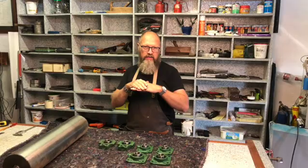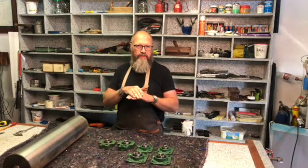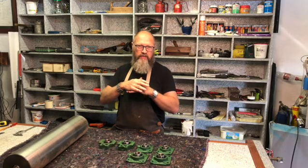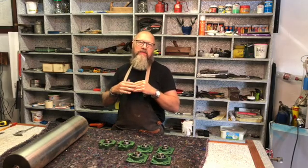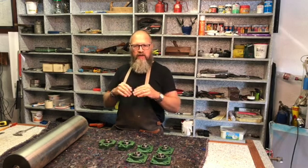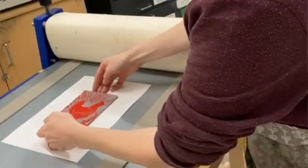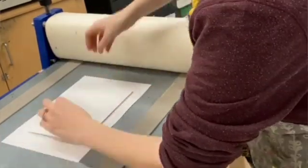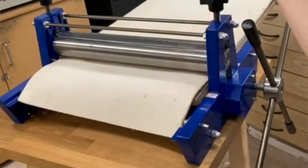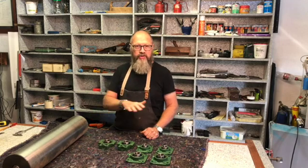On top of the plate you basically have a blanket and you put your etching plates, then two blankets. There's another blanket on top of that. Sometimes there's a third, thinner one. But mostly it's just two blankets and then you put the pressure of the rollers such that when you turn the wheel the rollers force the plate and the paper through and pressurize it equally — uniformly pressurized.